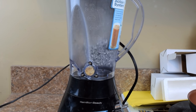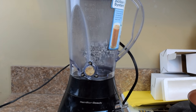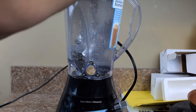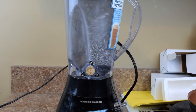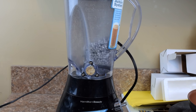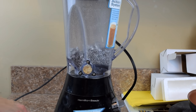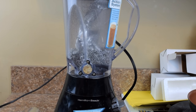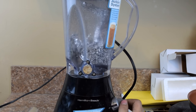This is where I will talk about the first safety measure. While grinding up aluminum in a blender, it will produce fine aluminum particles that will float around the air, just waiting to be sucked up into somebody's lungs. This is very, very bad. No foreign substances — especially dust of any kind — should enter the lungs, otherwise it can cause difficulty breathing, or even strangulation of lung tissue that can blister and cause a pulmonary edema, where your lungs fill with fluid and you can drown. Beyond that, aluminum has been shown to have possible links to Alzheimer's, so always wear a dust mask or be outside with the wind to your back when you open the blender top.